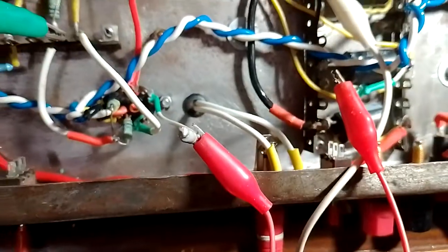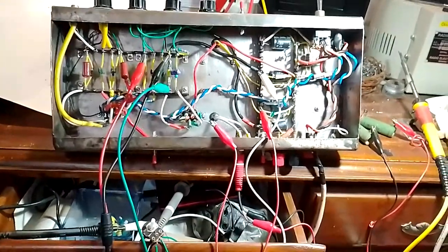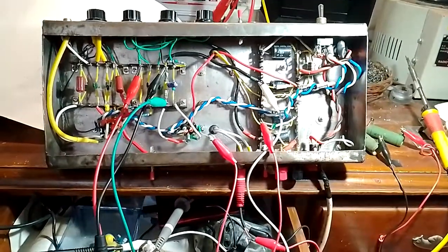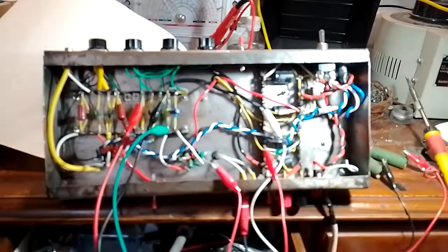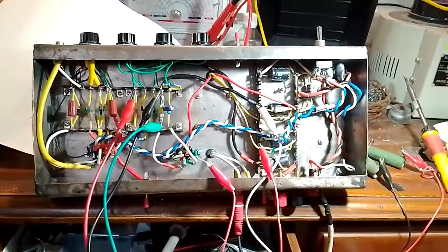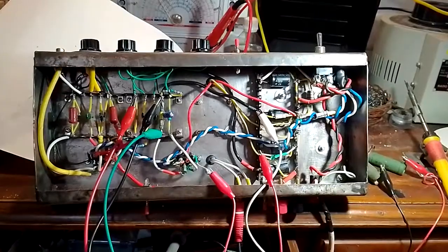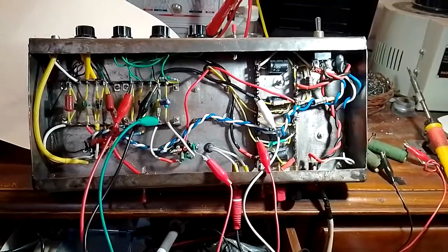But I think I'm gonna hold off attempting to connect a speaker until I do something about this first. In regard to the power supply, I feel that I should wait till I get the 12AX7 in, because it affects the loading, how much the power transformer secondary is loaded down. So I could fandangle it now, but things could change when the current draw increases, and maybe it would drop too much with both tubes inside. Let's see.